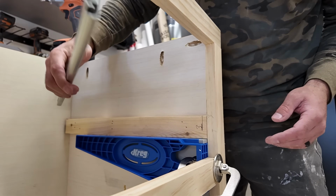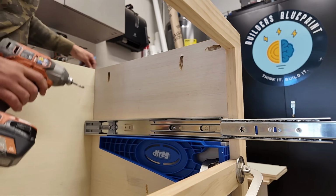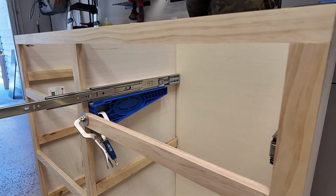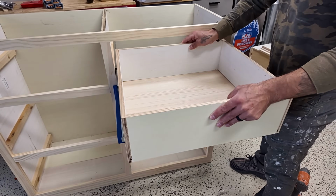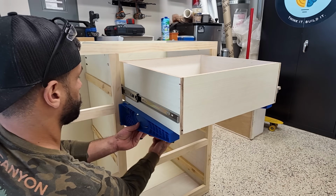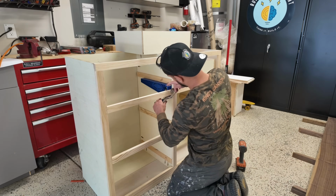Now that the drawers are all finished up, it's time to install them onto the cabinet. First, I'm installing the drawer slides with this really cool Kreg jig that I picked up at Lowe's. I'll put it in the description below. I then flip the Kreg jigs around, set the drawer on top of them, then align the drawer slides and just screw it in. Then basically repeated the same process over and over until all the drawers were installed.